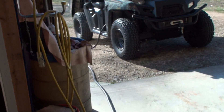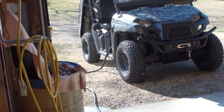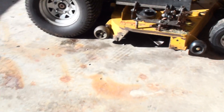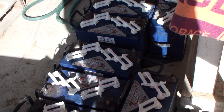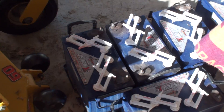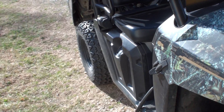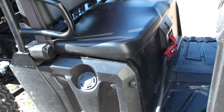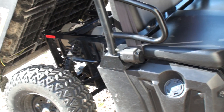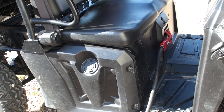That's the end of this project. It's really not that difficult to swap over the batteries — you could possibly use a different kind of battery. Here's the original battery sitting here, so that's what was in it originally. The amp hours on the replacement batteries are about twice what I had, which doesn't seem to cause any problems. I've been around the yard a few times with no issues at all. It actually sits just slightly lower — the batteries are about three inches lower down — so there's more weight lower.